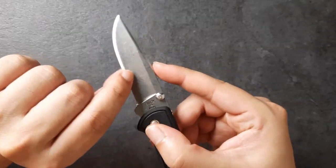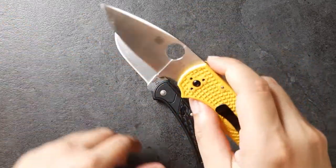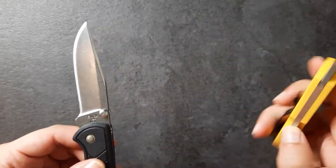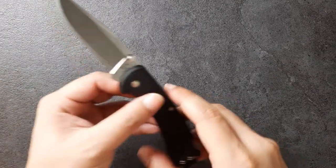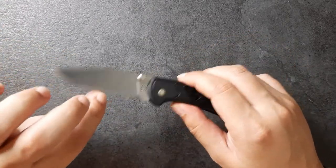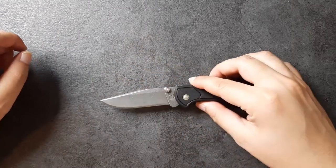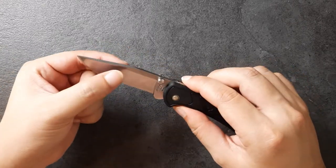Not only is it hollow ground, but the bevel is actually quite wide as well. The edge of the Buck is much steeper than the Spyderco. I checked with my friend who I bought this from and I do not think that he sharpened it himself, so I think this is completely factory edge. That means it's really thin behind the edge, and this thing slices surprisingly well. I think that's why it manages to keep its working edge a lot longer than I would expect from 420 steel, because of that really thin hollow grind leading to that really thin edge.